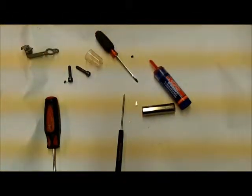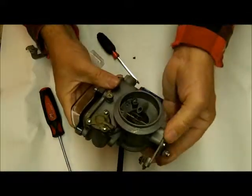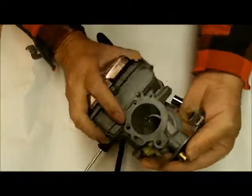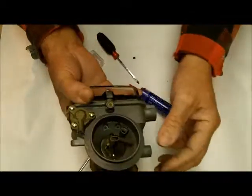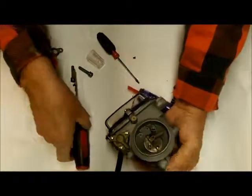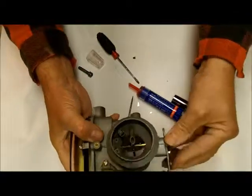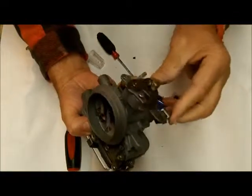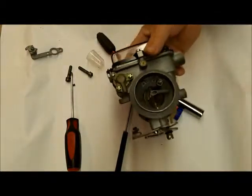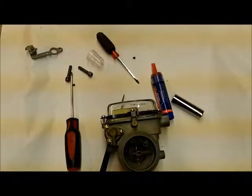Thank you for watching. I brought it back so you can see the finished result here. On this side I used a screwdriver, kept tapping on it until I got it in there just right. 'Just right' means it's clear on both sides so that the choke bumps up all the way. So there you go — no slack. Just a little tip for you that might help you out when you're working on your Holley 1904. Appreciate you watching, and you can find parts for this carburetor at mikescarburetor.com. Thank you.